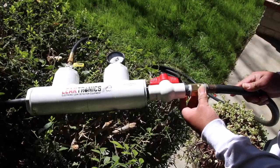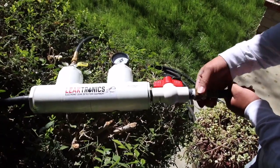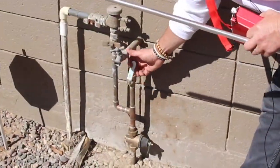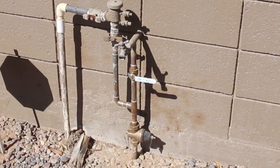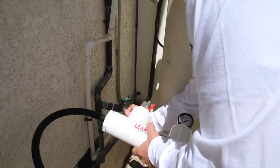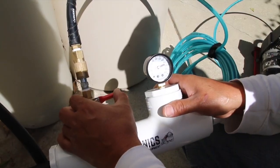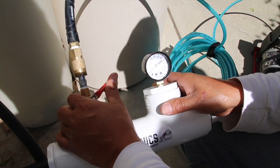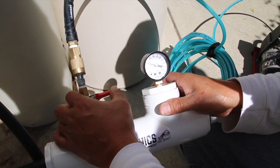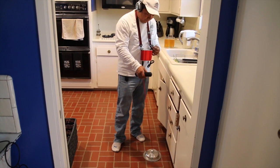However, when we're dealing with plastic pipes, we're going to have to pump those pipes up with air and water. We shut the system down at the meter or at the house shut-off if available. We bring our pressure rig in somewhere outside of the house — for example, hooking up to a hose bib. With everything shut off, we pump it up with small amounts of air and water.